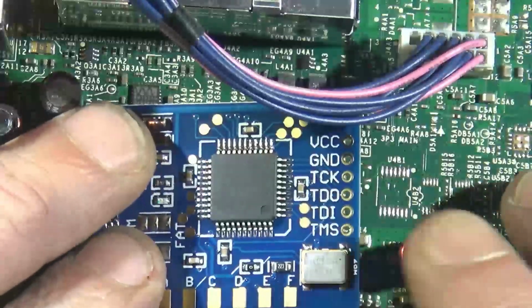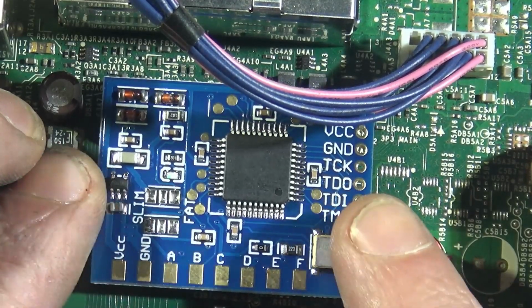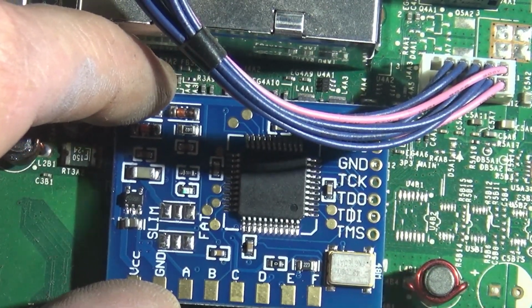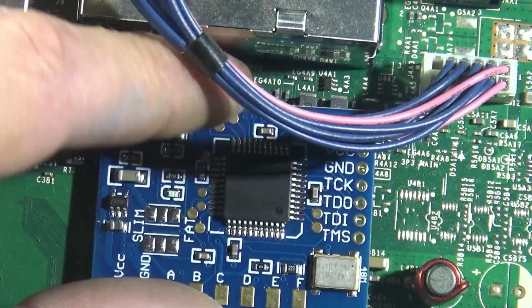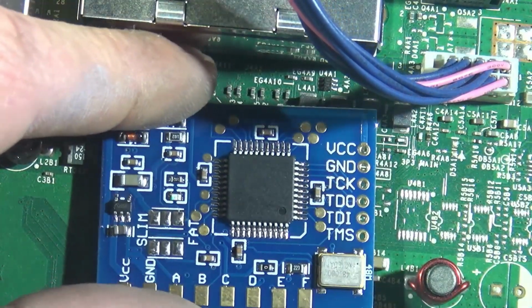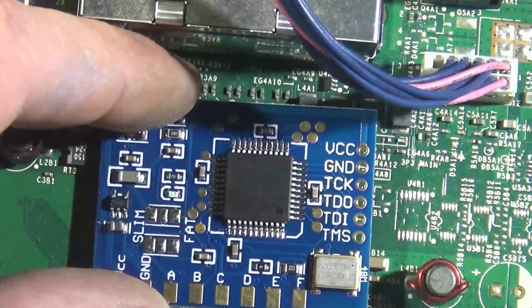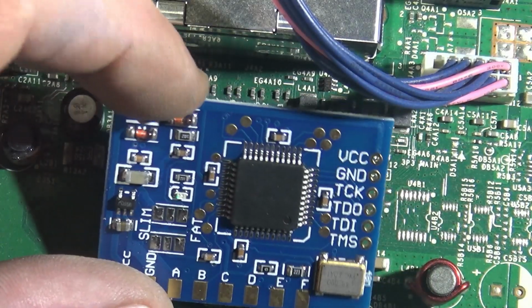Okay, so this mod supports multiple different mod chips. For Corona specifically, you're going to need one with a crystal oscillator. There's no onboard clock point for those. For Trinity, there's quite a bit more options. You don't need the onboard oscillator, so you can use a Matrix without the oscillator. You can use one of the RevC clones. You can use an Ace 3.